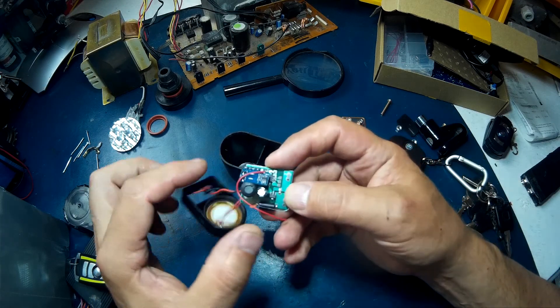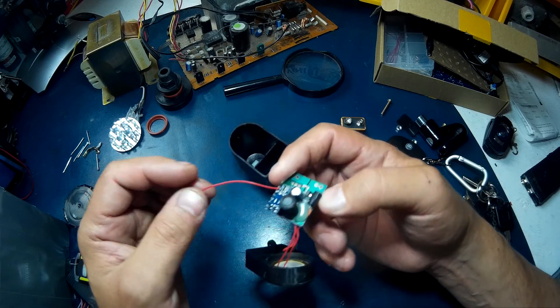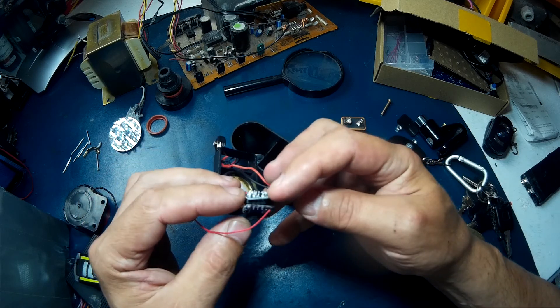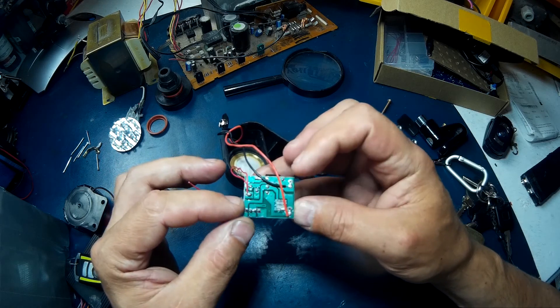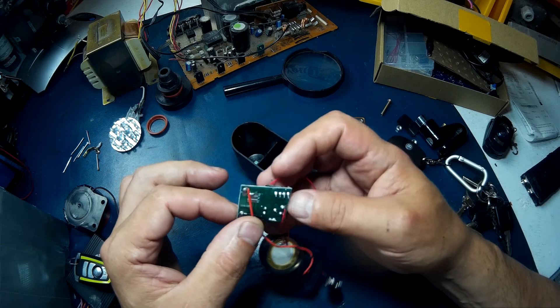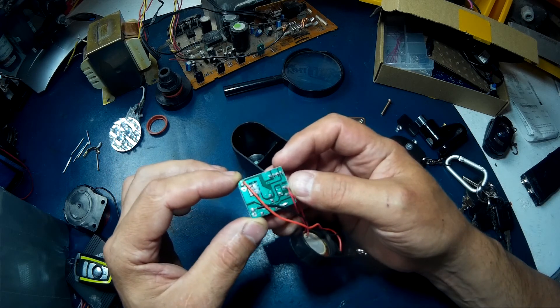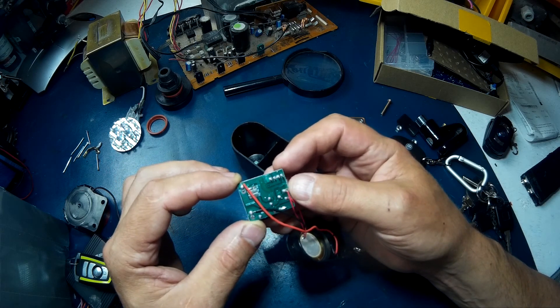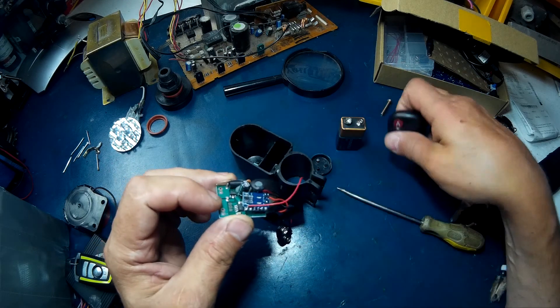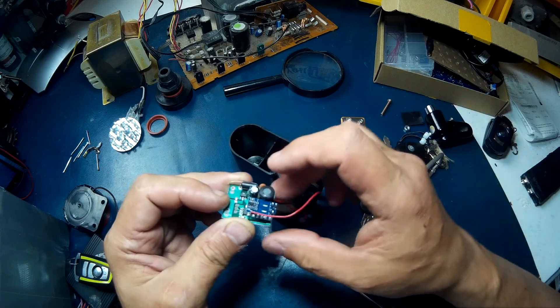There's your electronics. It's got a separate WiFi antenna — you could actually separate that board and use it for other devices. It's a four-pin connector, so two of the pins would be for voltage and the other two are basically just a switch, so you could use this remote on some other device.